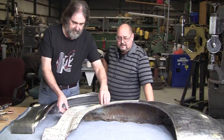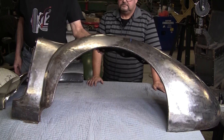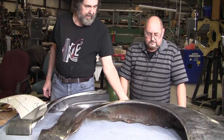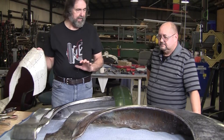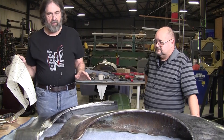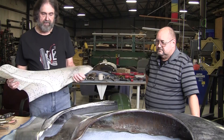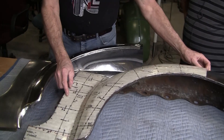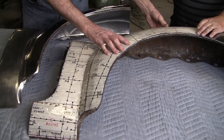As you can see, the MGA fenders are fully curvy fenders. There's nothing they held back as far as design goes — there are a lot of really intense curves, a lot of flanges and everything else on them. They're not by any stretch a simple piece to make. Ian started from zero as far as shaping metal goes. He'd seen a lot of my videos and knew what the flexible shape pattern could do, so I had to make this flexible shape pattern right off this fender here.